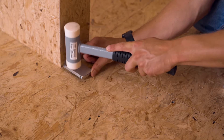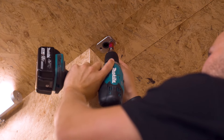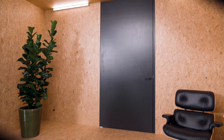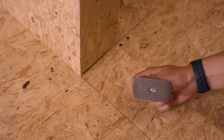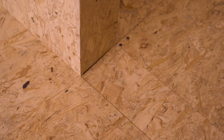Today we're installing a System M32 Plus and a top pivot 40 millimeter in this door. Our pivot door is always located at 40 millimeters from the side of the door when using this system. This door is 2.6 meters tall, 1.2 meters wide, and weighs about 80 kilograms. Our first step is to mount the floor plate onto the floor. We're working with an oriented strand board floor and will use the square stainless steel floor plate for System M and System M Plus.